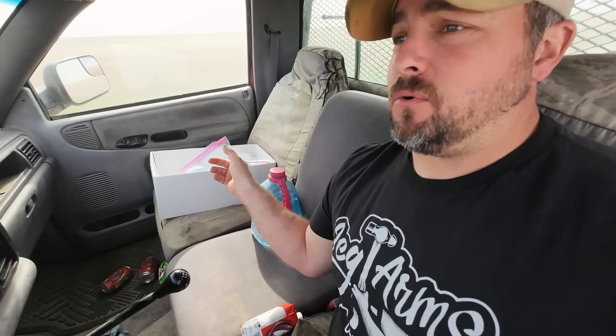We got the 450 motor injectors right there in the box. Clean them up, they look decent — we'll find out when we put them in the tractor. And then Brian up here ahead of me in his service truck has got the 600 injectors from our buddy Dusty. So we're going to go through and swap injectors out, and we're hoping that's the problem. What a deal.